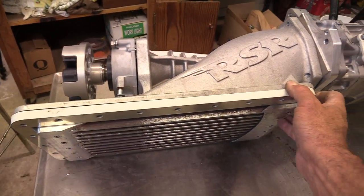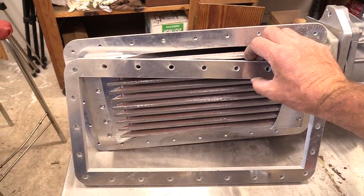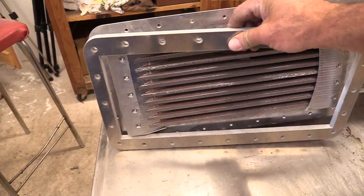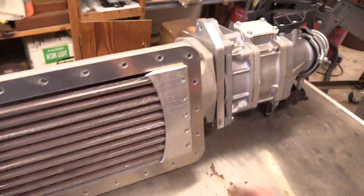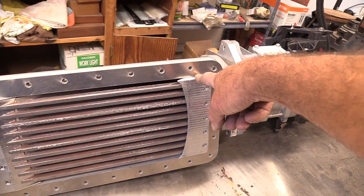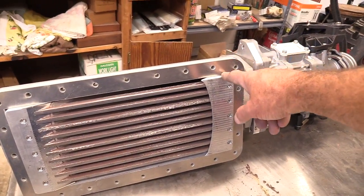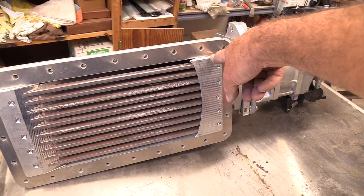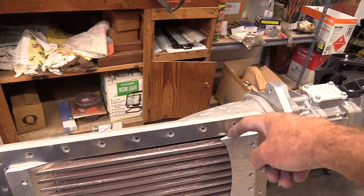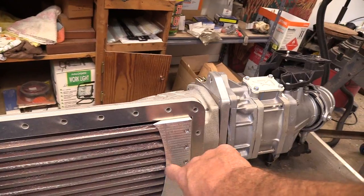Everything here is looking good. This is the welding ring I bought from RSR. It's one piece — not welded pieces to make the ring — made out of one piece of metal, and it's a half inch thick. When this goes on here, the grate actually sticks three-eighths of an inch below it. They sell another welding ring for boats that are not putting UHMW on, and I assume those are considerably thicker to match the grate depth. The grate will stick down, so that space is taken up by UHMW — you don't want it sticking down below your UHMW because it would catch pretty easily on things.